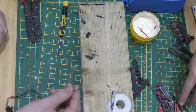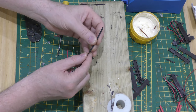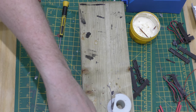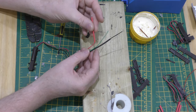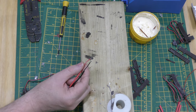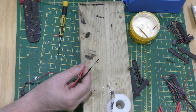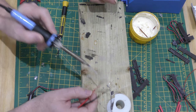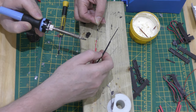Now you need to put the sheath on each end of the wires. Remember you're only doing the black and the red — you're not doing the green. Now what you need to do is attach the capacitors with the grey part facing away from the point motor. Dip it in the flux, hold it horizontal and do not move it. And I want to show them how to connect — basically, that's simple.